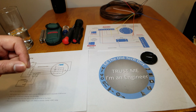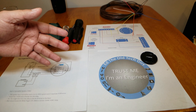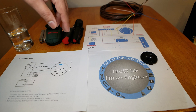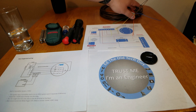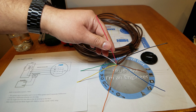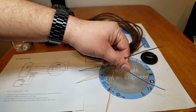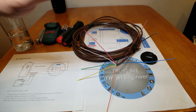Sometimes repairmen don't want to run new wires, so they'll use an existing wire regardless of color and just jumper it, or there'll be wires jumpered together with only certain colors left over. To make things tougher, some colors are interchangeable. Your primary colors in a heating and cooling forced air system are red, yellow, white, green, and black or blue. Black and blue are interchangeable for your C wire, which can get interesting.